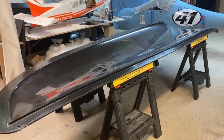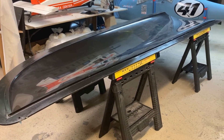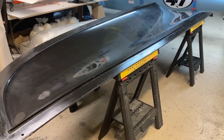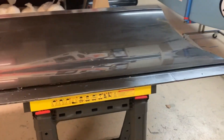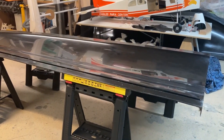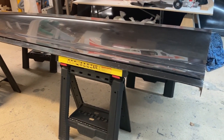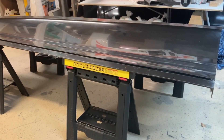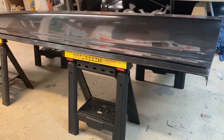Initially I was going to fixture up both skins with the proper dihedral angle and lay up the skin tip to tip. But after thinking about it, this makes more sense. It'll be a little bit more work, but the reason I'm doing it this way is because I do not have the spar tool cut yet. The spar has dihedral in it and I would have to fixture these at a precise dihedral angle. If I get that wrong, the spar is not going to fit. So I'm going to just lay up the skins individually.